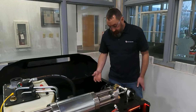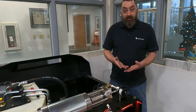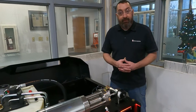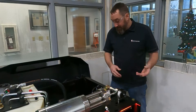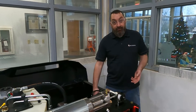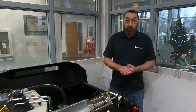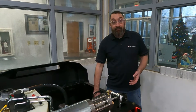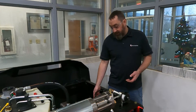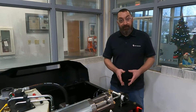If that's spinning and everything looks good there, but you're still getting the 40 psi or low inlet water pressure alarm, you could have an issue with the booster pump. We do have a guide on our website on how to replace it if your booster pump did go out. The biggest reason for failure is starting up the intensifier when the booster pump starts but you do not have water pressure going to it — that can wreck a booster pump very quickly.